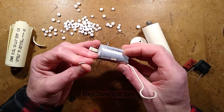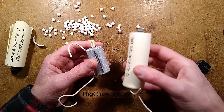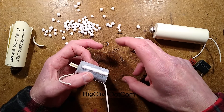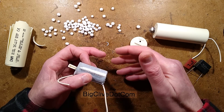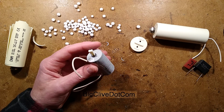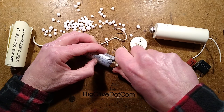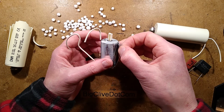But fundamentally, I'll cut into this so we can see what's inside, because it's quite unusual to see the way this is constructed - you can even hear this one rattling. If you want to know what's inside the igniter, I made a separate video about that. The ballast has basically one main winding but it's got a tap in that winding, and the igniter just taps that tap - it just pulses it and causes a high voltage that strikes the lamp. I'm going to make a slit in this and we'll see what happens. I've got a very sharp knife - bad news for fingers. What we're going to see here is a spiral layer of conductive foil. Or is it going to be foil and plastic? It is separate layers.